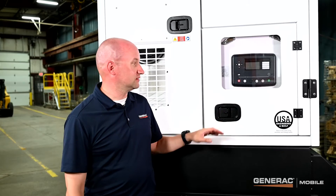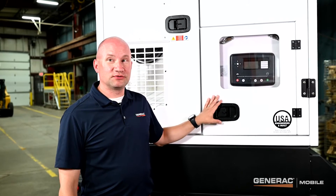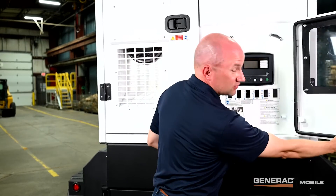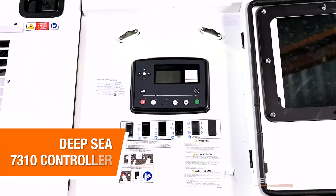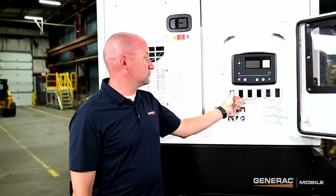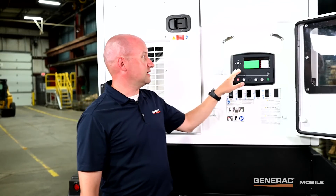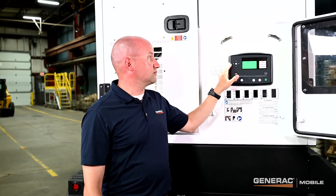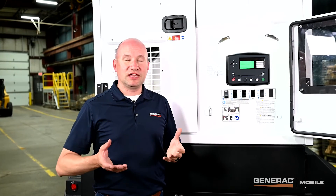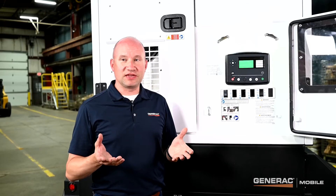Also at the bottom are our shore power connections for the battery charger and the coolant heaters which Enrique mentioned earlier. The controller for the machine is located at the back away from the electrical connections. The controller is behind a padlockable door with a window in it, enabling the operator to walk up to the machine and see the current status without having to open the door. The standard controller with this machine is the Deepsea 7310 controller for non-parallel capable machines. The controller is turned on just by using the rocker switch. It has a backlit display along with scrollable menus to search the different options, including configurable start and stop timers, maintenance reminders, and other features of the machine for ease of use for the operator.